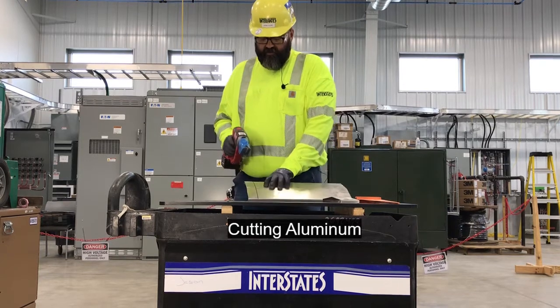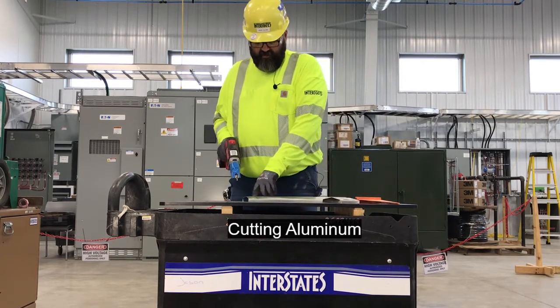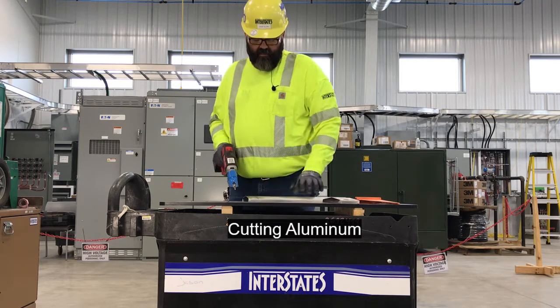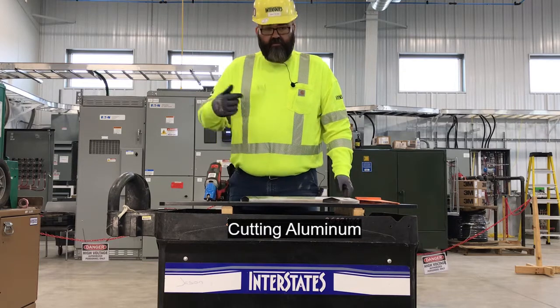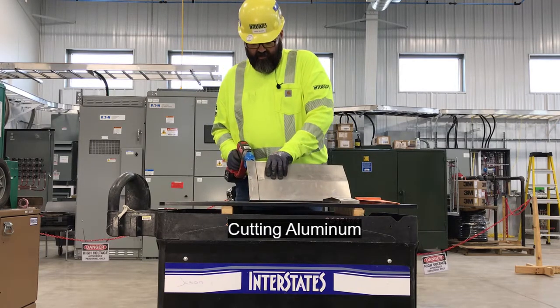Now remember, it's going to cut a 1/4 inch out of the center of it when it goes across. So if this line is our measurement, we need to cut on the edge of that line with our 1/4 inch curly Q going off to the waste side.